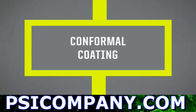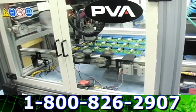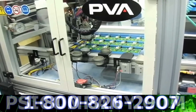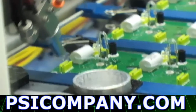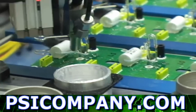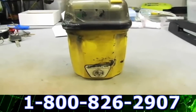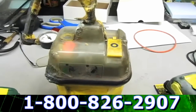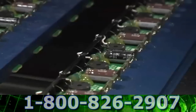The boards have been tested, tuned, and approved by quality, and the next step is we conformally coat them in a layer of silicone, which basically we spray with silicone and we cure it in an oven. The value of conformal coating is that it allows us to protect the board from electrostatic discharge. If for some reason the case should ever be compromised, it protects the boards from water intrusion and gives it a better chance of working in a crisis mode.